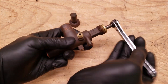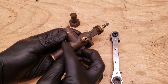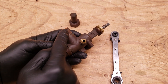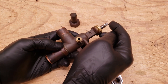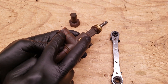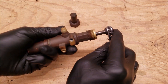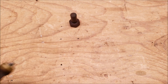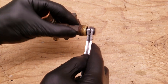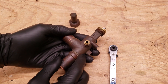So if you were to turn this all the way down, that would be the front seat position — when this pipe is locked off. During that time you're going to be able to pump down the system. Because this is connected to the evaporator, you're going to have access to this port. You'd be able to tell when you have completely pumped down the system when you're at zero PSIG. So right now it's still in the mid-seat position. In the front seat position, it's all the way down clockwise. You need to go ahead and tighten it, just like you do on the three-position service valve for refrigeration.